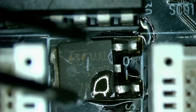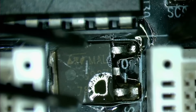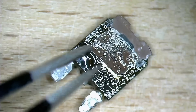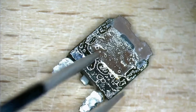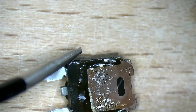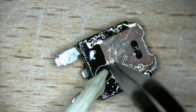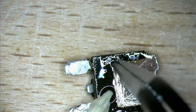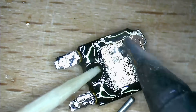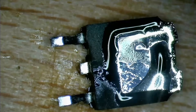At least I only had to desolder two pins to remove the component. I use low melt solder to carefully remove the chip, and after two or three tries the IC comes off without issues. Under the microscope we can see that the underside of the IC is brown — this side is supposed to be connected to the board, but it looks corroded and full of rust. The top layer can be scraped off easily with my tweezers. After a few rounds of applying solder and removing it again with a wick, I got the metal surface of the IC nice and clean, covered in a thin layer of fresh solder.